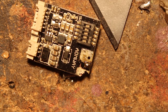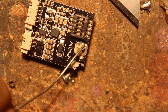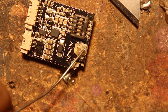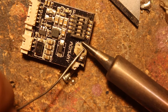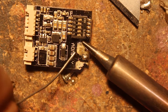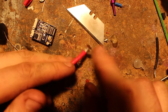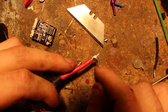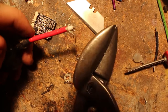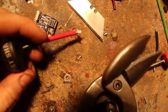Try to get the old solder off and then try again. As far as the outside pads, they're all pretty damaged, but there's material left just there. So we should be able to solder the outside of our antenna ground onto that portion of it. What I'm going to do is remove some of the extra outside wire because we don't need this much to actually attach to the board. I'm going to cut it back with these — which is not the right tool for the job, but it'll get the job done just the same.